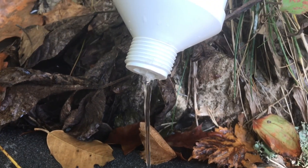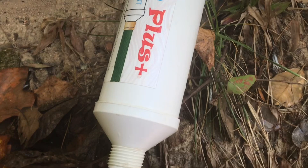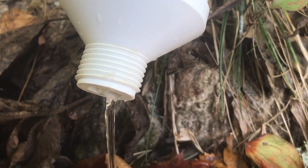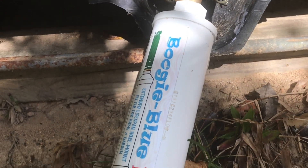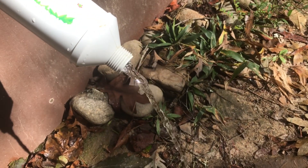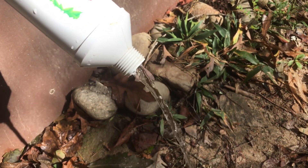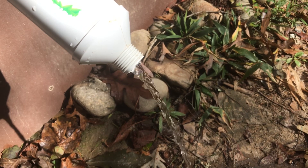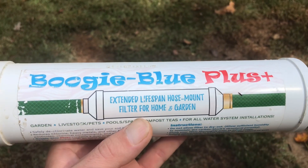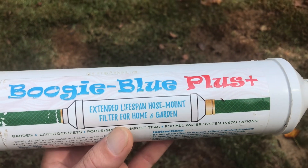Not too bad — just the weight of the water pushing through there. It's a five-micron filter so there's a lot of restriction, which means you need pressure to push through it. It would fill up a bucket in a few minutes this way, but that's not the preferred method. It could be used like this in a pinch. At about 20 PSI you can see the flow increases quite a bit just going up a few PSI. If you've got this on a 60 PSI pump, it'll scream through there. A dual-stage filter that filters down to five microns — you sacrifice pressure for water quality.